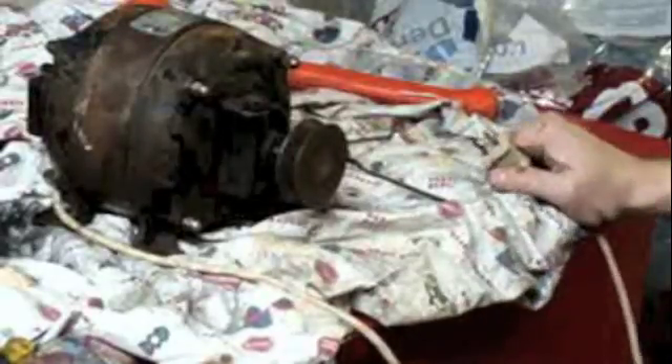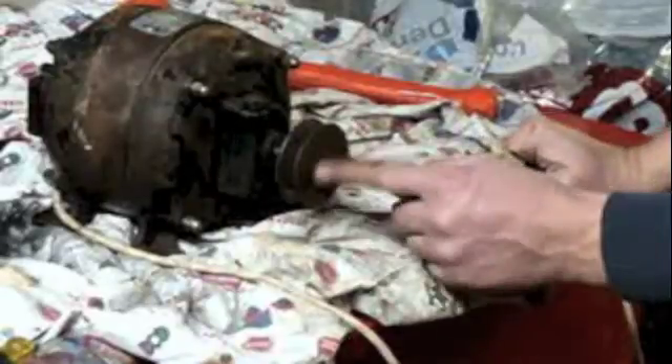The battery is dying - let's move quick. It goes counterclockwise. Okay, so this is a split phase induction motor. I've seen split phase induction motors before, but I've never seen one made this way - the squirrel cage, the part that normally is a winding on the outside, is actually kind of inside out. What GE did on this motor is put the windings on the inside where they rotate, and that's why you have brushes.